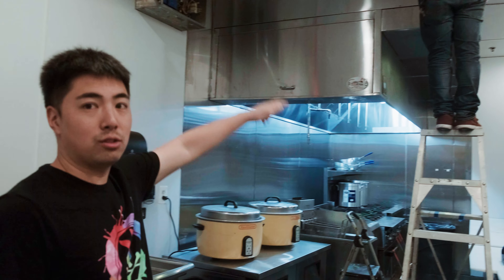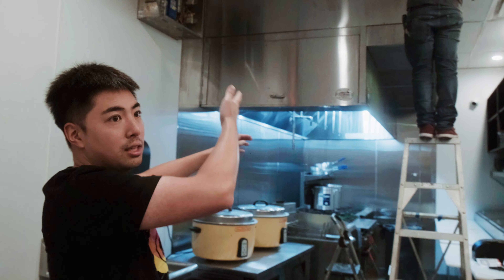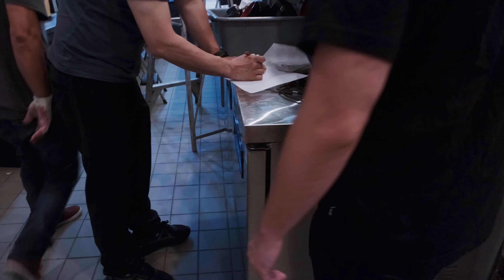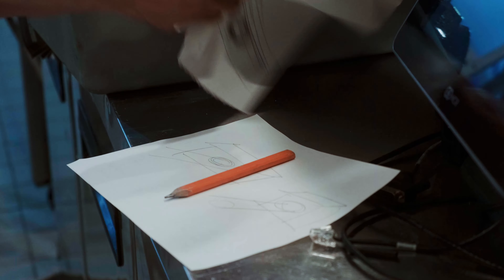Basically, Gusto Farm didn't have any air coming out of their exhaust hood — no air coming to the exhaust hood, no air to push into the hood that feeds all the smoke and everything. So you make a box, tie the duct to it, and then it'll push the air down.